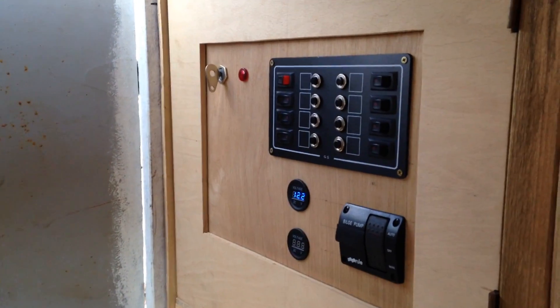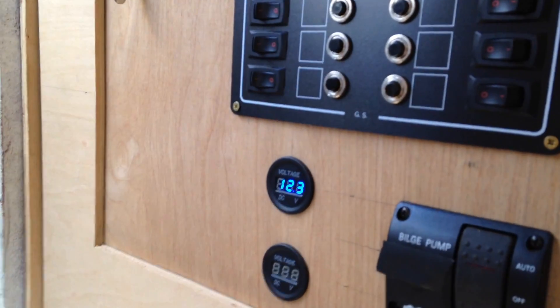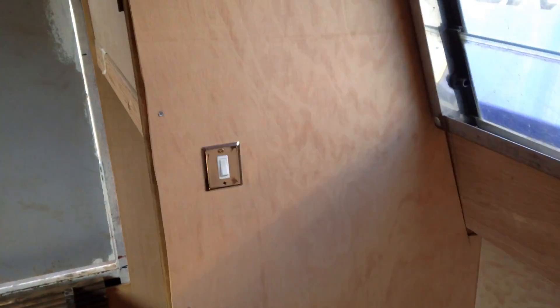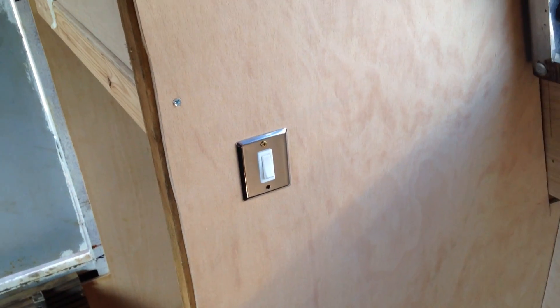When we last spoke I put the control panel in and got my voltmeter working. We started lining out the top half of the boat with plywood sides all the way down, and I've finished that side and started coming down the other side — that's all complete as well. I've also started putting in the bases and boxed in the end of the control panel, putting a light switch in here for the living area, or saloon as it's known.